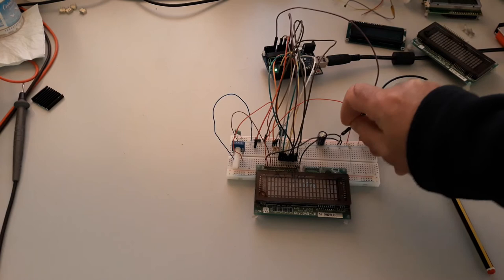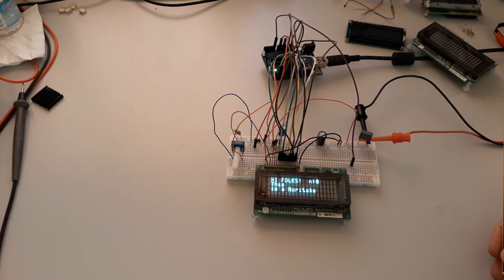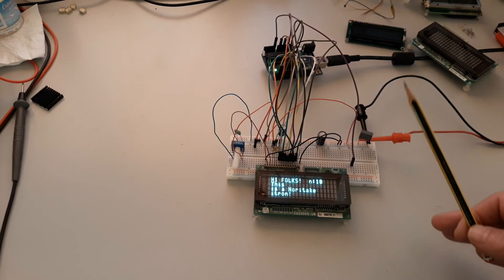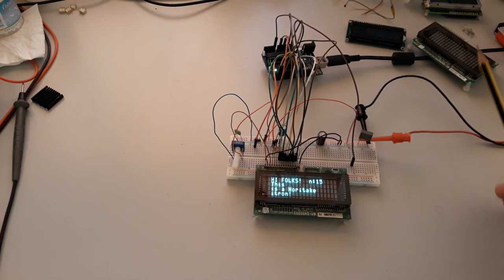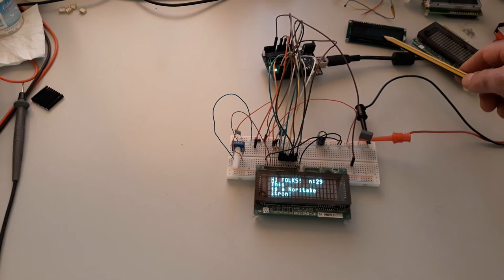Trigger the resistor, okay, and do a new reset. And now you have 4 lines active on this kind of VFD. Note, I only need to change the line where I write LCD.begin 16 by 2 or LCD.begin 20 by 4. Only this line needs to change, because all the other lines are exactly the same for both systems, okay, in this case the 44780 or Noritake VFD.